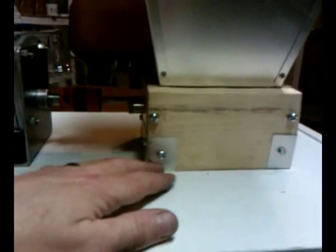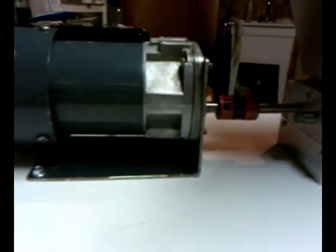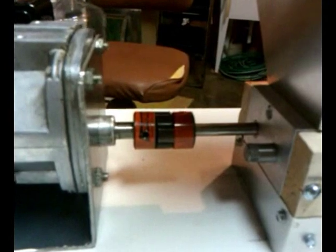What's up folks — the grain mill is pretty much done. I apologize, I hope this video quality is okay because I'm using my phone, and the audio didn't sound too good on the first few clips. As you can see, the barley crusher has been mounted to the little cart — I centered it up over the pre-marked lines where I cut the hole. I went from underneath and put two wood screws on each side, so it's not going anywhere with the 7-pound hopper. Next I lined up my motor, which already had the holes drilled, and I had enough play to get everything lined up. My Lovejoy coupling lined up really well.